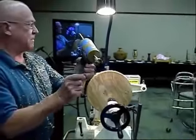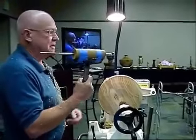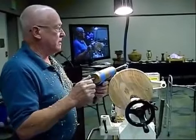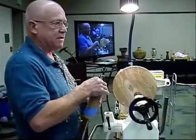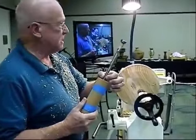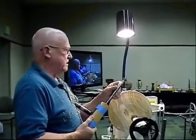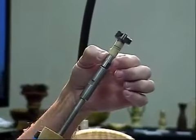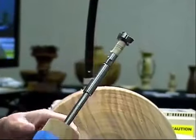I just made it and welded it on there. It's a piece of angle iron welded on top of a 1-inch post. I cut this piece, actually a piece of sycamore, and cut a hole in it. Here's your horizontal drilling jig. This is a kind of different, unique chuck; there are three of these out there. There's a kind that has set screws on the side with a little bitty shaft. This is a German-made one, I can't remember, is it Fox? Colt. Colt, there you go. It's a 1/8 turn twist that locks in there. It's a cam lock system, so you don't have screws or anything to grab on here. I like this.